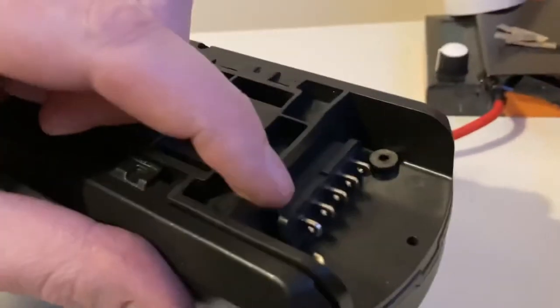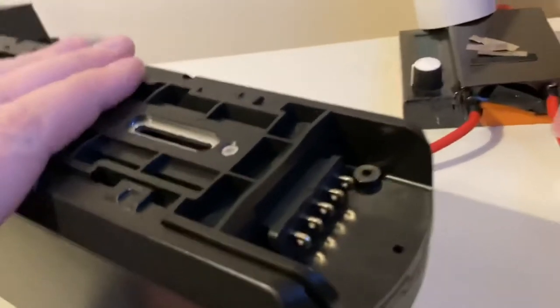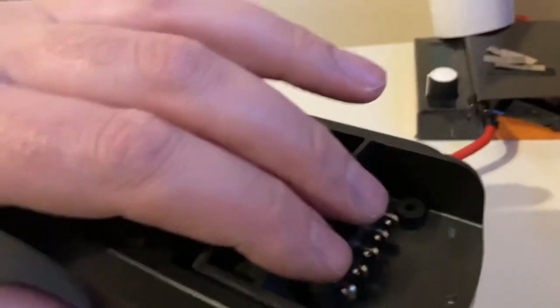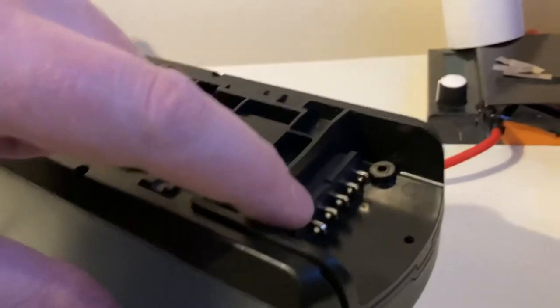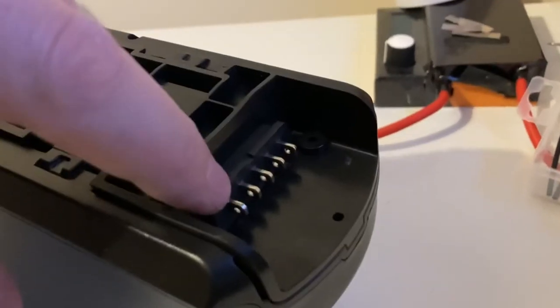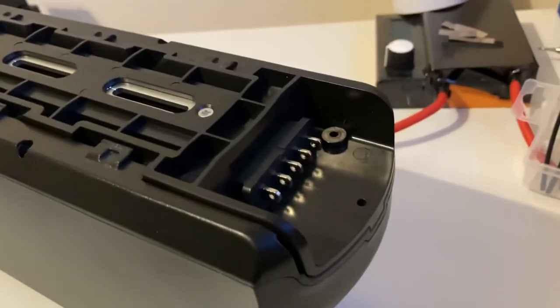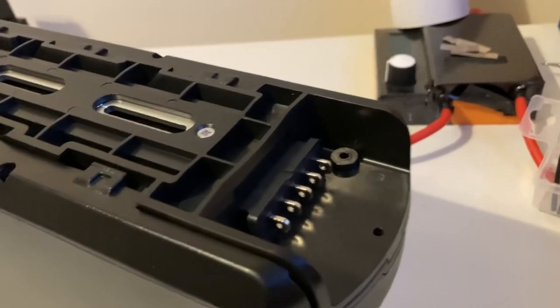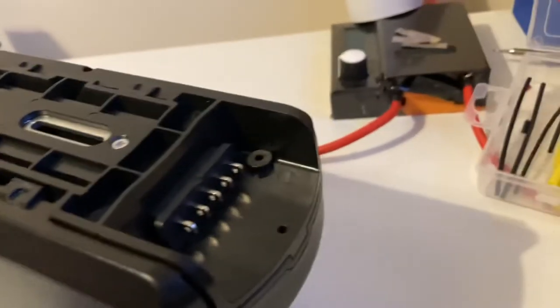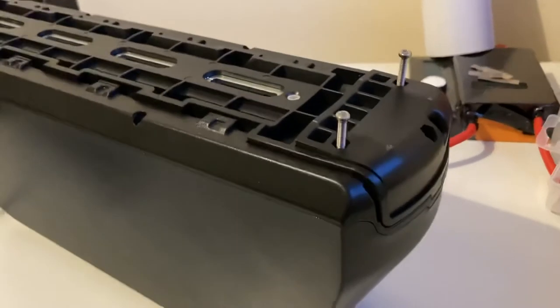And they're the main positive and negative that's going to be coming off the bottom of the battery. I'll take this out. You've got that, positive, negative. And then you connect the battery to your bike. And then that's the main. So I'm going to have, just like I've done on the inside as well, two negatives and then two positives and two negatives coming off that. Going to an XT60, I think. I think that should do it. So yeah, little cable coming out of there with an XT60 on it. I think that should do it just nicely.